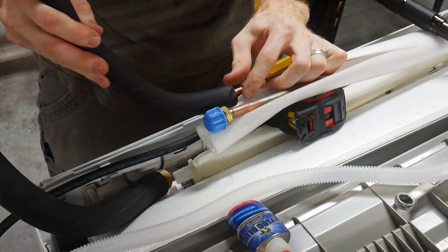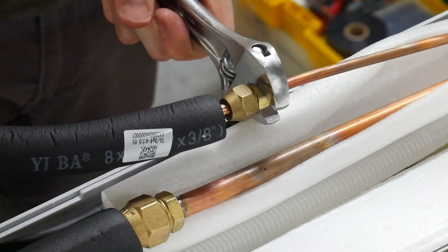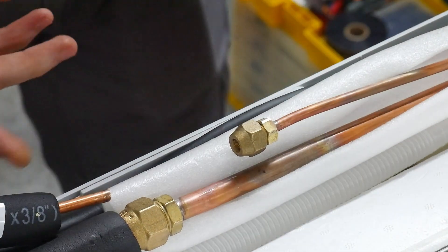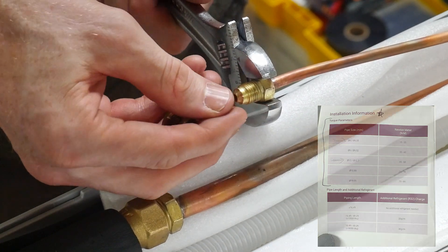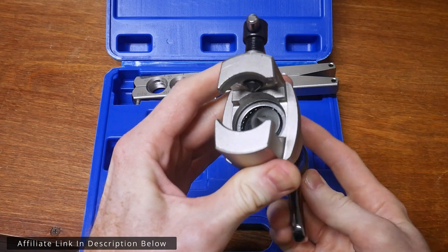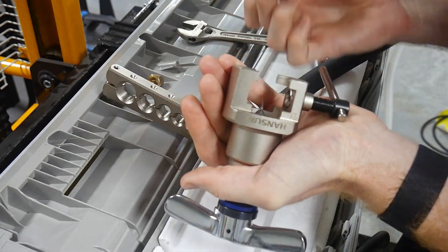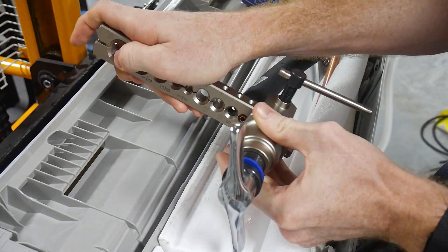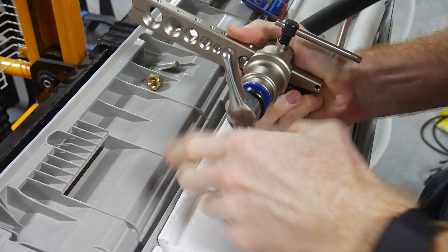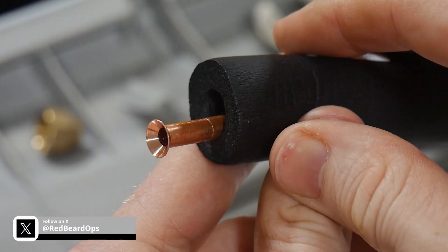One thing I don't love about this unit is that the lines are 12mm and 6mm, which are not as common as the imperial 3/8 and 1/4-inch lines. I also felt these copper lines were more fragile than my last install. I ended up over-torquing the 6mm line trying to achieve the torque settings in the manual and had to cut and re-flare the line multiple times. I'd highly recommend picking up a flaring tool that handles both imperial and metric sizes. I like to let the copper stick out about 1/16 of an inch from the clamp, put a little nylog on the tip of the cone, line up the cone with the opening, and start tightening. Once you hit the appropriate tension, the handle releases — saving you from over-torquing the flare.